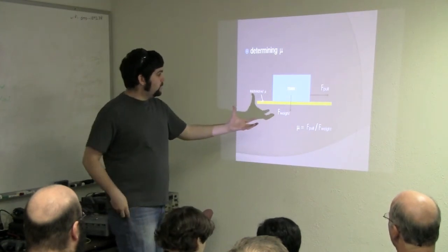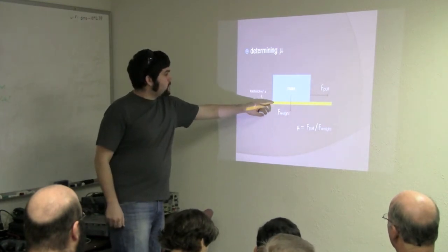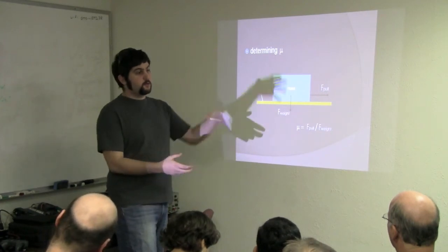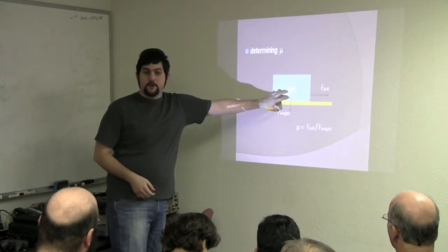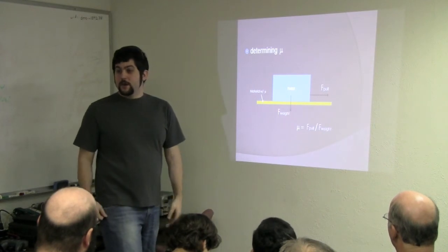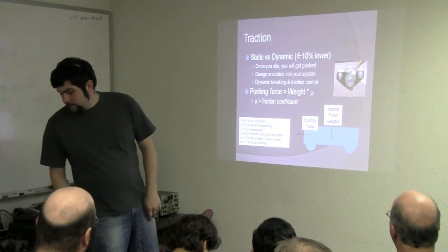So you take a mass of a known mass and you pull it, whatever the material interaction is. If you're trying to do a tread against a carpet, you load it up with weight, you pull it, you figure out what force you had to pull with before it starts to move, you figure out what your weight is, and now you know what your mu is.